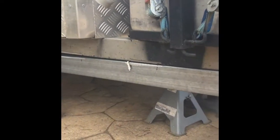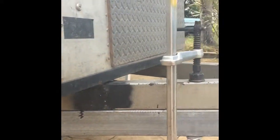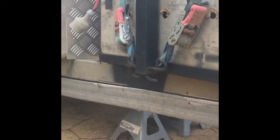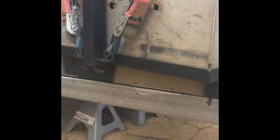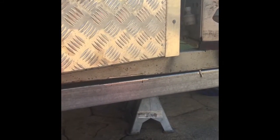I'll do some welds at the front here and then make my way back while I use the jack to bring down the top section. I've welded the front - that's all anchored now. I'm just going to grab the jack and put that under and try to find the sweet spot where the drawbar will flex back down to match the new piece and then weld that one.